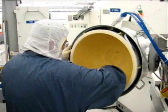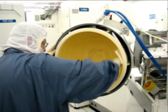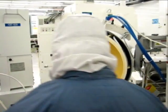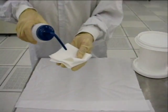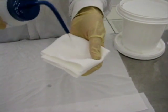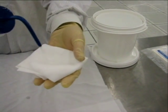In preparation for the final wipe, take a cleanly rinsed Ultrasol sponge and wipe down the entire dome. It is important to use a lightly dampened Ultrasol foam wipe for the final wipe, as Ultrasol foam wipers will not shed fibers when wiping the ceramic dome. To properly saturate the Ultrasol foam wipes with DI water, fold the foam wipe into quarters and apply DI water directly onto the wipe. Due to the characteristics of the foam, the DI water will need to be carefully worked into the wiper.